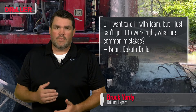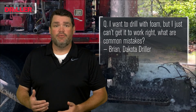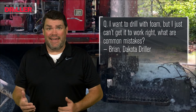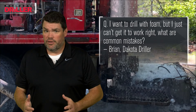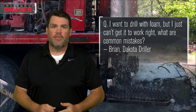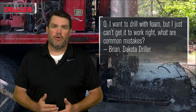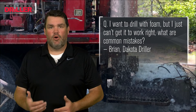Foam drilling — water is a very important aspect of making sure that we have a good foam mixture. If you think about it, we start with a half a percent or one percent foam. So that means 99.5% of the entire contents of our foam mixture was water. So we have to pre-treat. If you talk to any of your manufacturers, my buddies at Bayroid, they're going to say, did you pre-treat? Did you knock that hardness down to less than 100 parts per million? With that, we increase the pH and then we get a good foam mixture.